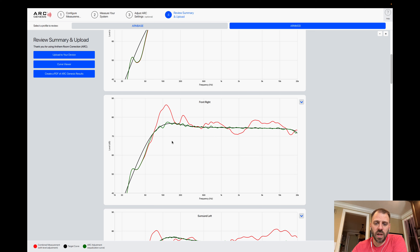Left, center, and right are all tracking pretty well — a little squirrelliness around the crossover region, but we're within plus or minus a dB or two. You can see these speakers all peaking around 120 Hz, then dipping and peaking again. They're all at the front of the room behind the screen, all getting a very similar response curve. ARC is trimming these speakers up quite a bit — they all have a plus several dB applied. These are the Focal IW LCR6s.